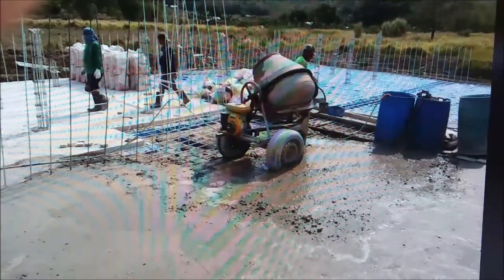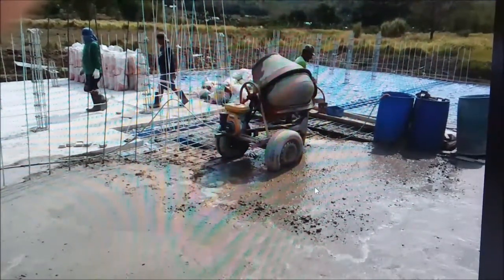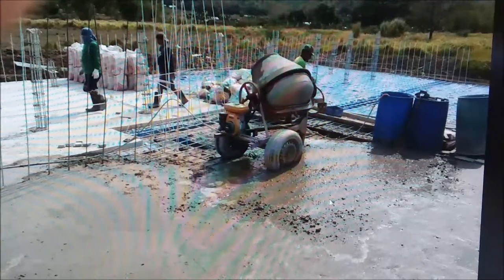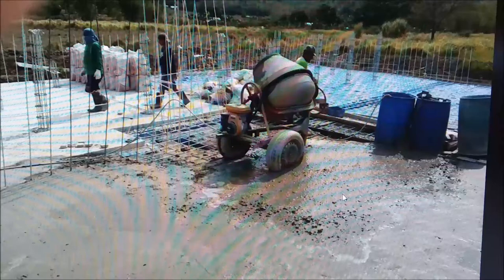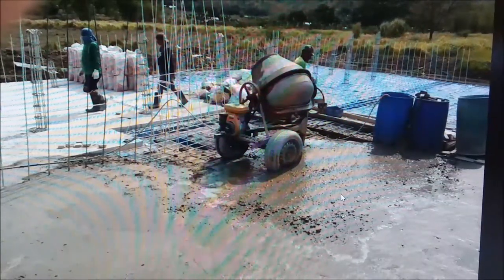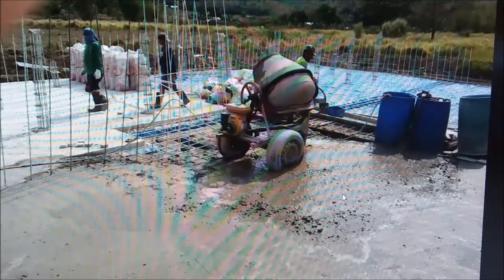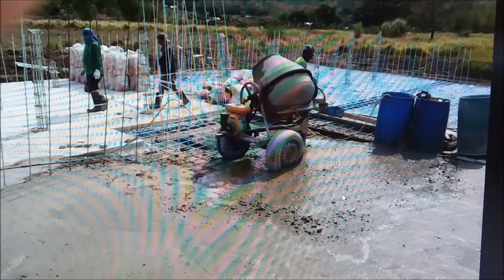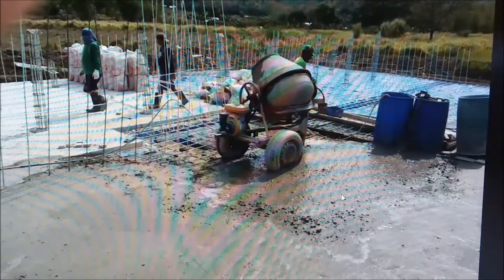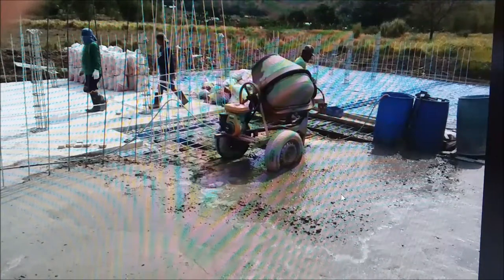This here is ready for finishing. Really close right behind the mixer, this is already showing what we call water rise. When you pour concrete anywhere in the world, you pour it out and run a bull float or a screed board over it just to get the mountains out of it and get it spread to about the right thickness. The bull float pushes the surface rocks down.